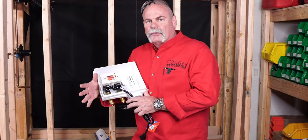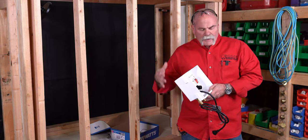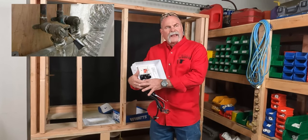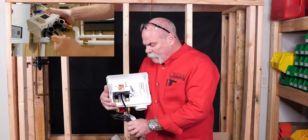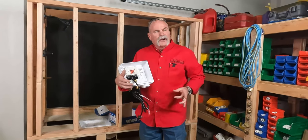This thing does some really cool things. When it detects power from your washing machine — meaning it's running — that valve is open. But if it detects that your washing machine is not running, that valve is closed. It's like taking the pressure off your hoses every time you finish using your washing machine. Watts makes a wonderful retrofit so you can take a washing machine box with widespread valves or one like this and install the IntelliFlow valve on it. Once it gets plugged in, you plug your washing machine in here and hook your hoses up here.